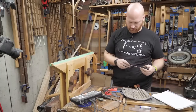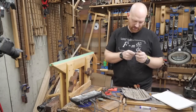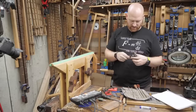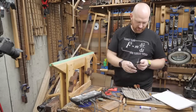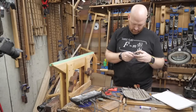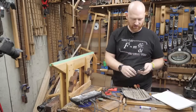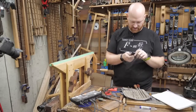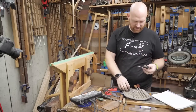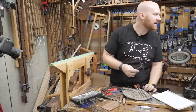Then those aren't. Now with this one, I want to put it at about 5 degrees of rake, except I want it to rake the other direction. So let's loosen that up. And I want about 20 degrees of fleam on this, because it's a crosscut. We're going to crank that down. Now we got this all set up just like we did before.